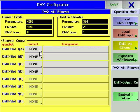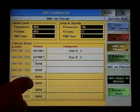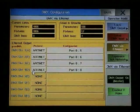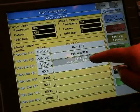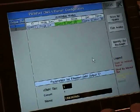Consult the manual of your DMX via Ethernet node to see which protocol it uses. By pressing the configuration soft key next to the required universe, you will open a new dialog window that automatically detects any compatible DMX via Ethernet nodes connected to the console. You can then select which node and which output on that node will be outputting the currently selected universe. Each of the protocols is configured differently and has different options, as the nodes themselves are very different.